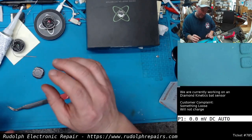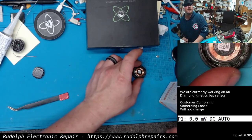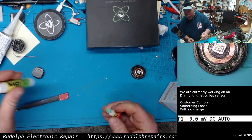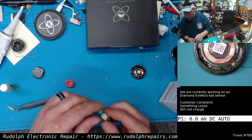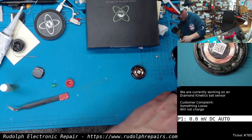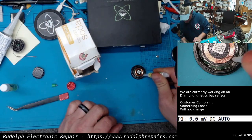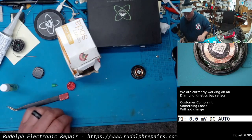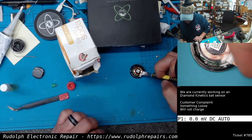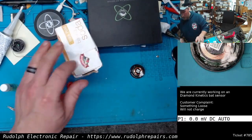One more time. Every time I move that coil, I want to make sure it's still working properly before we glue anything down. That would not be good, to have to scrape off this super glue baking soda. In that case, I would have to completely disassemble the whole board, and the board seems to be potted with epoxy, which is not fun to try to get out. A lot of scraping, heat, etc. Okay. Too much is okay. Just blow it right off. No big deal, right?